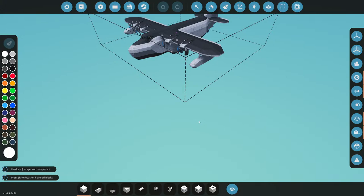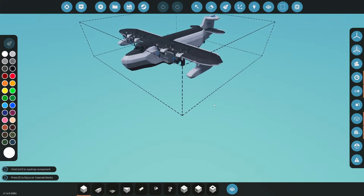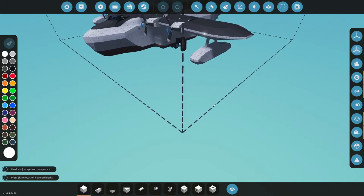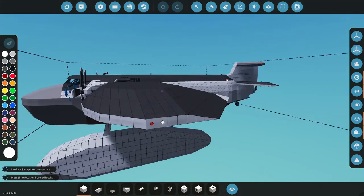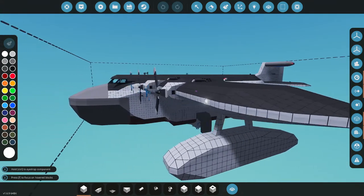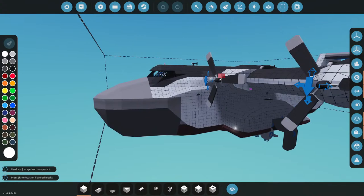When you do a fixed pitch propeller, you choose either to have a climb prop or a cruise prop. Let's say you have your own plane and you often go on a couple hundred mile journey every once in a while. You probably want a cruise prop. When you're doing training work, you often have a climb prop. With a variable pitch prop, you can always have the right propeller pitch for the regime of flight you're in.